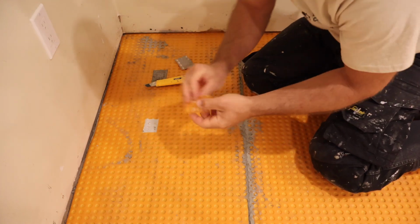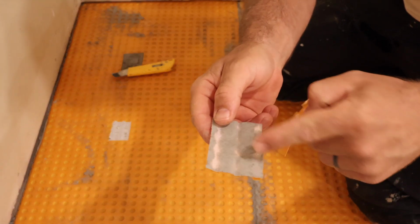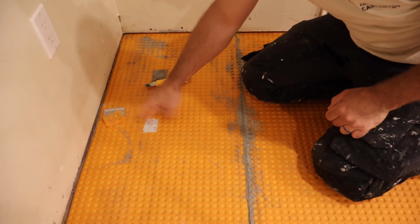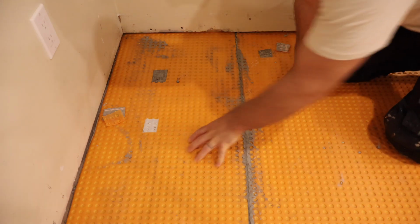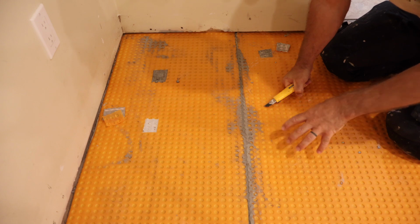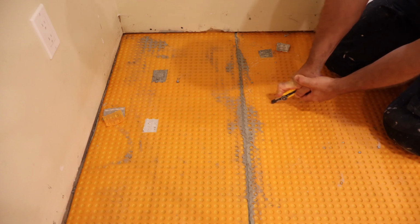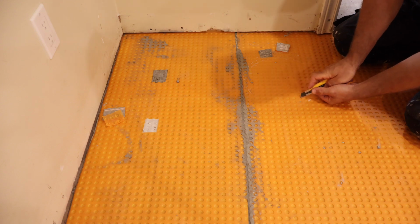Yeah. You can see it just tore the fleece right off, whereas with this one, the thin set was left on. So that fleece has definitely adhered properly. That thin set is dry as a rock underneath. Good sign. I am just gonna double check this sheet because I didn't use the same product. I didn't use the primer, and I used a different type of thin set, just a poly modified thin set. Actually, I want to cut a little further away from the edge, cut about here.